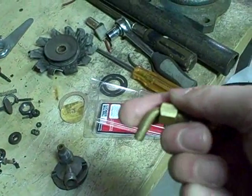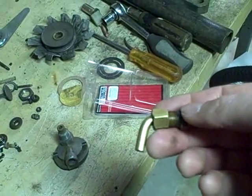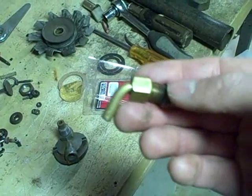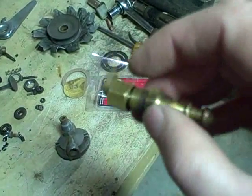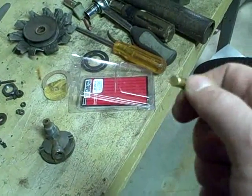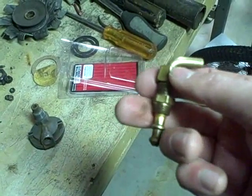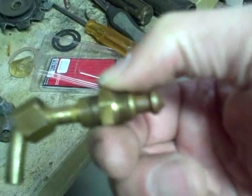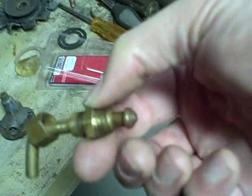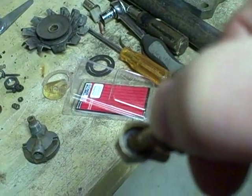So unless I want to try and straighten out this brass piece — I mean, that's a whole headache I'm certainly not going to get involved in. If I try and just straighten it up by force, it's probably going to crack and break off and then it'll be junk. I could heat it up, soften the brass and then straighten it, but let's not get crazy. So what I'm going to do is my best to fish out the old packing. And if I can't, I'm going to try and install new packing without taking the nut off at all. I've moved the nut back as far as I can and you can actually see that packing down inside there.